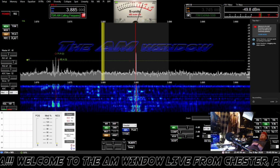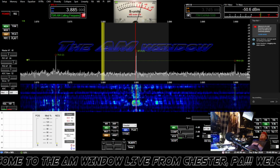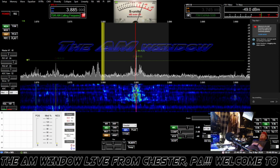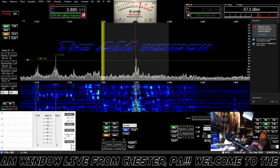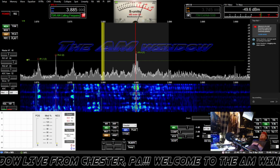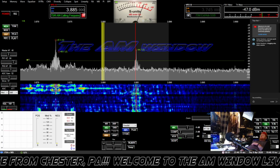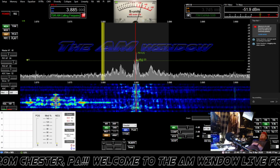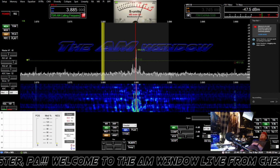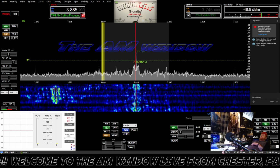To the cap pretty well. 6AX5 solid-state replacement. And you wire that to one of the filament pins that went to the 5R4. And you plug those pieces in. So what that does electrically is it uses the low voltage rectifier to feed both the high and low voltage filter reactors. So that'll drop your voltage down to about 350 volts or 300.